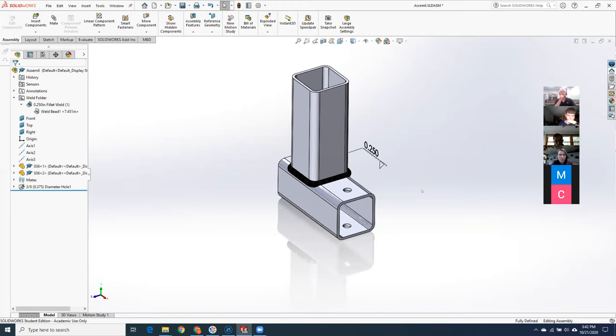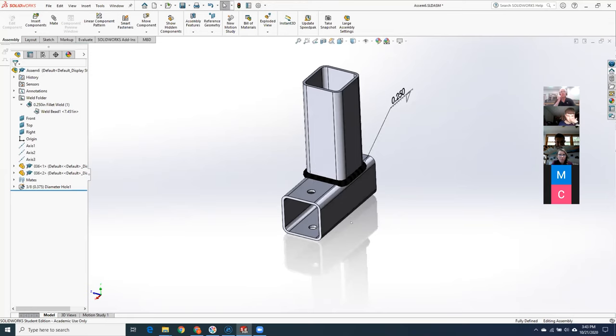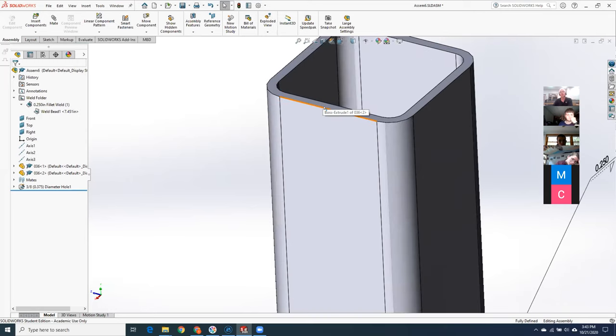So let's say that we're back at this piece. We've welded it, we've drilled a hole in it. Depends on what kind of grinding you want to do. For example, back to the airfoil, these surfaces were actually ground in a big grinder with diamond dust and oil. That's how they get to be so pretty. Even though this material is just awful to machine, it's really hard and yucky, but it grinds nicely. So if you wanted to grind the edge off this.